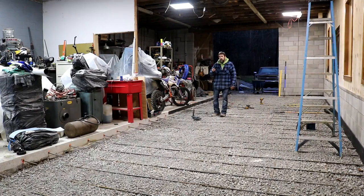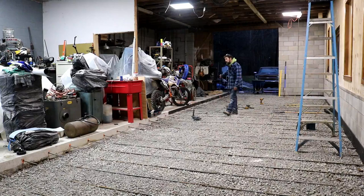The only benefit to doing it the way I originally intended was that it would take an inch of air out of the front, right? I decided I'd move the majority of my air up front, right? That gives me a good 2.5-3 inches that I can skim coat the top, and a thicker skim of concrete, if I use like a grout mix, it'll be a better outcome because it'll be thicker, right? It'll have more strength to it, I believe.